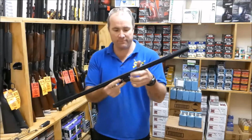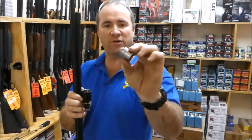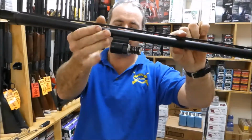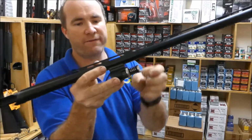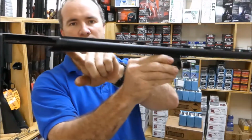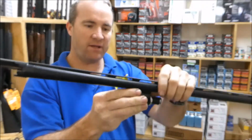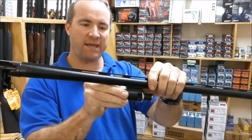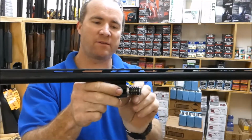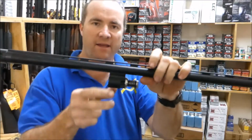The barrel, they call it a hybrid system. It certainly is gas operated. That's your gas piston, very similar to your early Berettas, a very similar style of system. You'll see it has a sprung section on the front, porting excess gas pressure off, so the piston rides up inside here. As the wad travels through the barrel, it's ported down through holes in the barrel into this chamber area here. It drives the piston backwards and cycles the action, so that will come back and the action is cycled. If it has excessive pressure, the spring here will compress, porting the gas forward, so you don't have excessive pressure driving that bolt back too hard and knocking the action around.